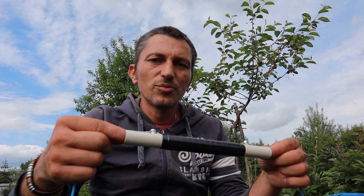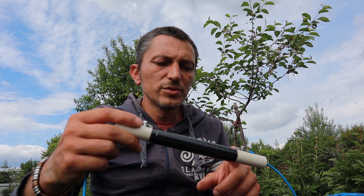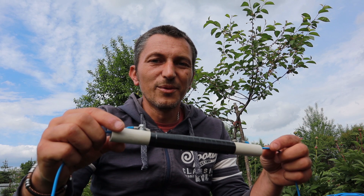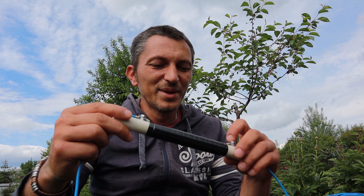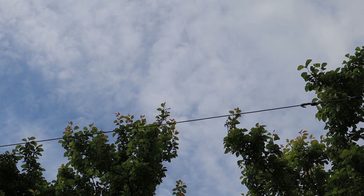Initially I had some 1mm copper wire that I wanted to use for the coil — I needed about 270 to 290 turns, but unfortunately the wire was not enough, so I had to build it with the 0.6mm wire that I had.